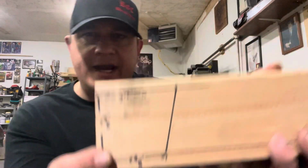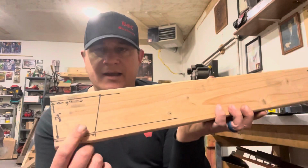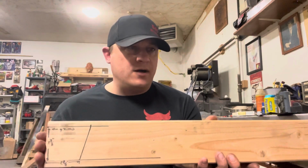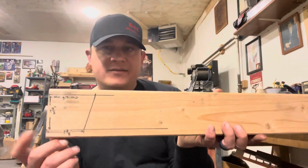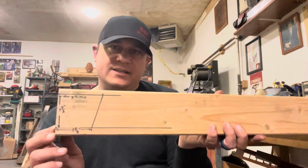Across is 2 3/8. You can narrow it to the closest 1/4 inch, like you could do 2 1/4 or 2 1/2. You've got a little bit of wiggle room. You have to remember, we're going to be doing some sanding on this as well, and we're going to do some coverage. The best way to cut one of these is the chop saw, because you will get a nice straight cut. A table saw works well. A bandsaw is kind of okay, it kind of wiggles on you. Just use whatever you have to make sure you can cut that straight, because you don't want to have to constantly fill in things. So let's get this cut.